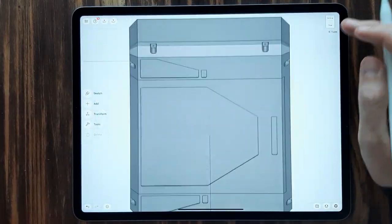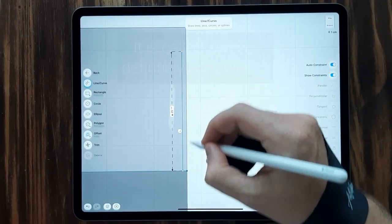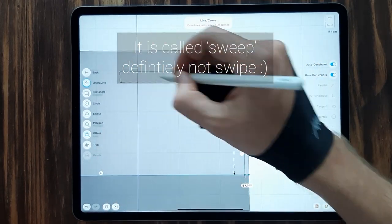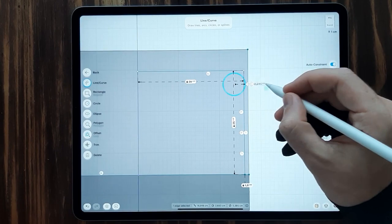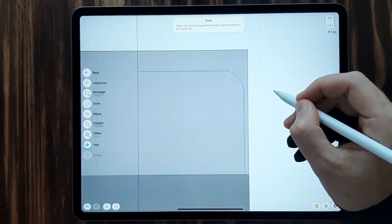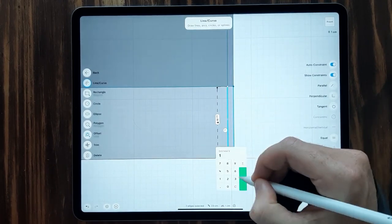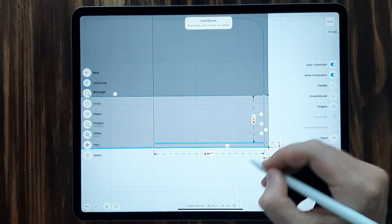And on top of that body, I'm going to draw the axis of the handle, because the handle is going to be round. So I'm going to use the sweep tool later on, but first I'm going to create the axis on which I can sweep a circle. So for this, as you can see, I created this sort of bent body which goes with the same lines as my main table body, and on one top I created half of it, well, not half, basically a quarter of it.